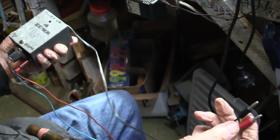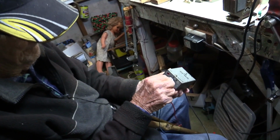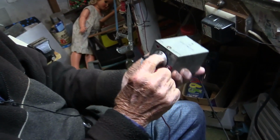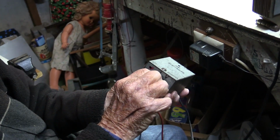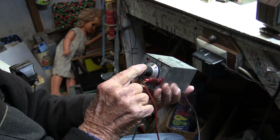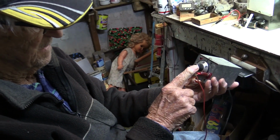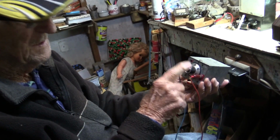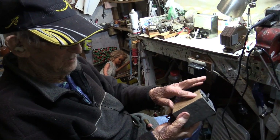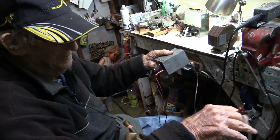I've got zener diodes in there. I'm on 3 volts now. Yep. That's my bugs. Oh, for your FM bugs? And now I've got 5. I've brought in a 5 volt zener, providing I've got, say, 10 or 11 volts, I can still get 9. I put it all on wood because I didn't have anything else. But I do use this quite a bit.